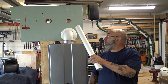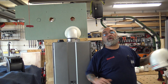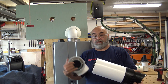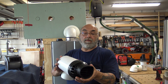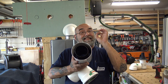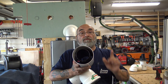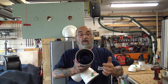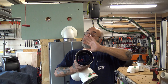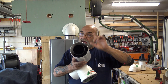What's going through here is the 11.5, then they make an 8-inch. Basically it's the concentric with the plastic inside — remember, condensing needs the plastic. The box will say 'for condensing models only,' so it has the dark gray plastic inside and the light outside. We're not going to confuse the issue — I don't have the other one, but that will be on another video.